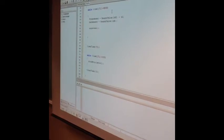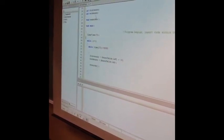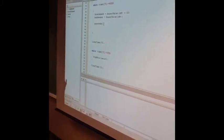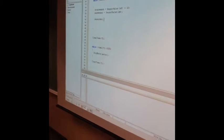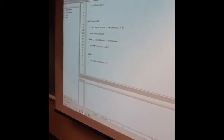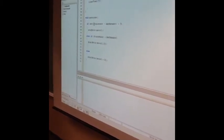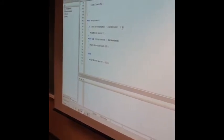Then I have a function. I put in the void function sensor ABS. I really only had one function, so to do the function I just did the one. So I have the function in here. Back down to here. Here's my function. Void sensor ABS. We have an equation in here for the if. Absolute number for the front sensor minus the back sensor needs to be less than 5.